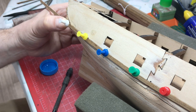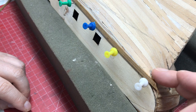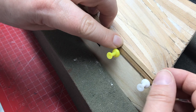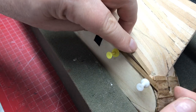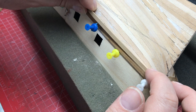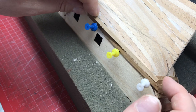Now that is in full contact the full length along, so that's nice and sturdy. The next plank has to deal with the curve here of the transom and needs to follow the form of the hull. We can't just overlap it like we did with the first one because we'll have gaps. So we'll be shaping this to fit in the first instance, then bending it so it fits flush to the hull. Rather than trimming at the transom as we usually do, we'll trim at the bow.